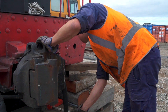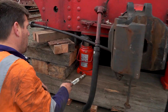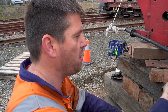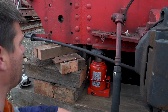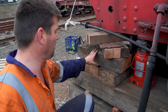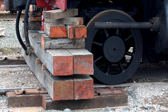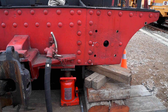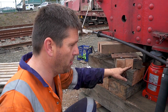The process of lifting the heavy loco used hydraulics and bridge timbers. "Here's our jacking and packing system. What we've actually got is the jacks here, so I've got a center line marked in there. There's some big pads welded on from the original SMR days, and these have come in really handy for jacking. We've got two 50-ton jacks front and rear, and as we jack it up with pigsty timbers — really strong timbers used for bridges — we borrowed those and cut up some sleepers to spread the load."